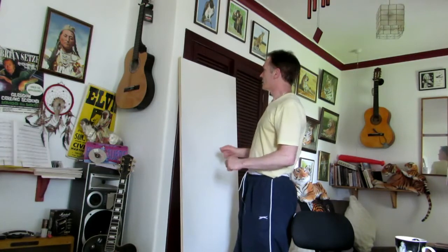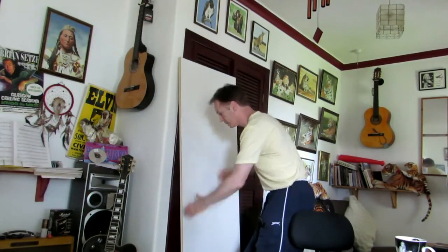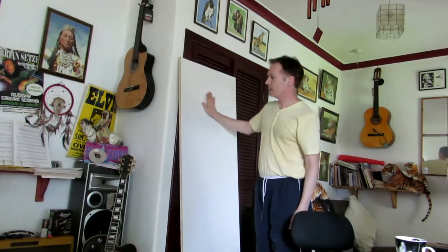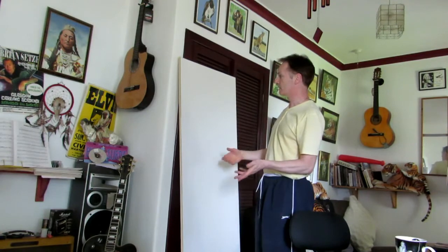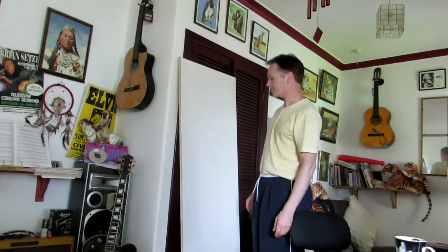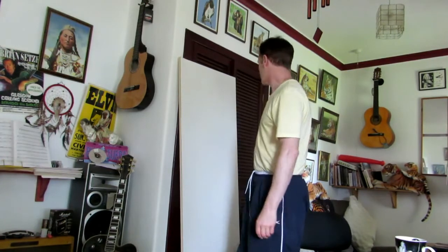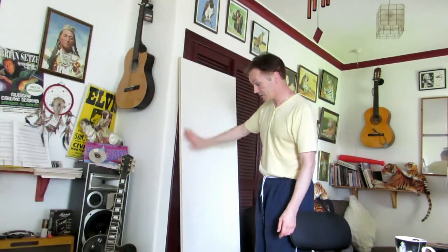You're only going to get problems if there's too much glue, as I've found out. So keep the glue thin and just a light coat on all the paper, then apply it and brush it down as you go, as you smooth it out. And it's absolutely perfect this time. The other time, as it started to dry, in the evening, some hours later, blisters would appear here, there and everywhere, and it's really difficult to get off. So that was a wee bit of a learning experience, but it's really quite simple when you know how to use that stuff.